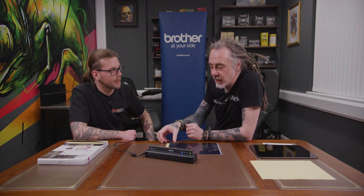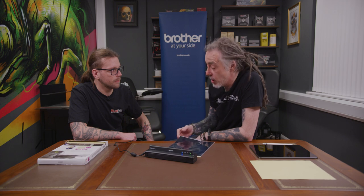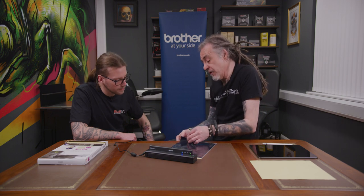The third troubleshooting issue: print comes through but there are uneven marks — rivers — on the print. What causes that? Rivers are caused by the printhead getting hotter than what the paper likes. This kit was designed to print onto fax paper, not tattoo stencil paper. The limitation is partly in the paper — it's just a bit thin. The rivers are caused when the printhead goes hot, cools down, hot, cools down all the way through an A4 document. By the time you get to the middle of the page the printhead is already hot and it's been printing for 20 seconds with another 20 to go.